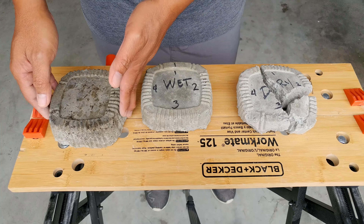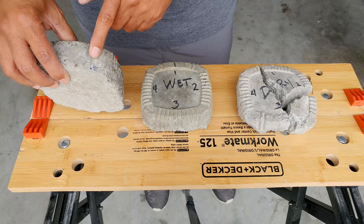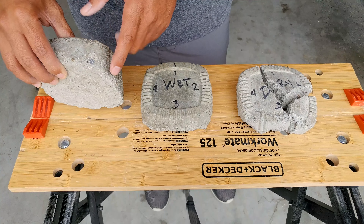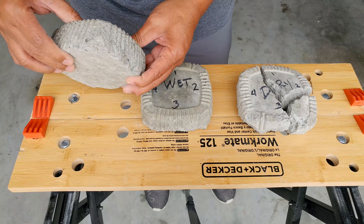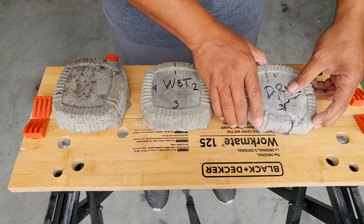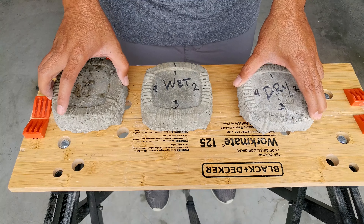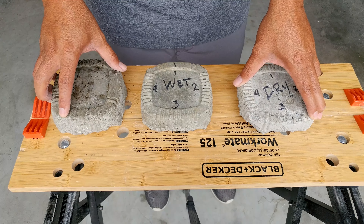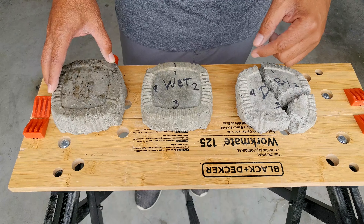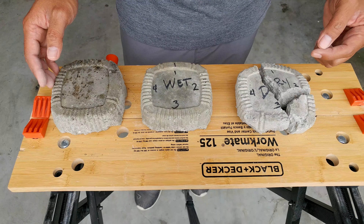Here's the break right there. If you look here, this is the seven-day sample we have — after one pass of the car, it received some damage to the side. I think this is about the same amount of damage that we received when we passed the car one time. So I would say that's about equivalent to 70% of the strength of the wet pour concrete. If you have not seen the previous experiments, I encourage you to watch them — I'll post their links in the card above and in the description below as well as at the end of this video.